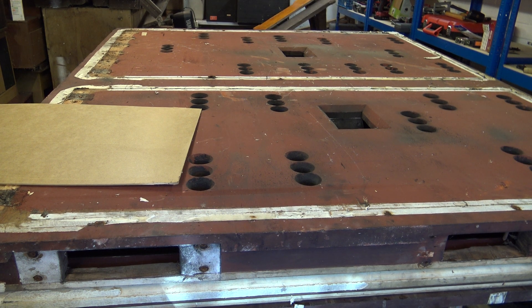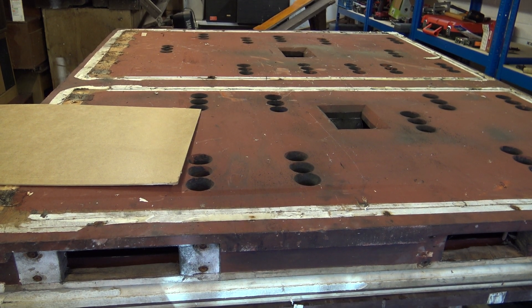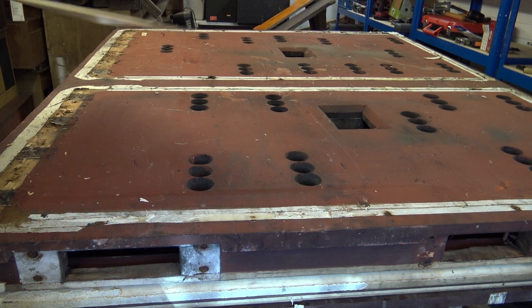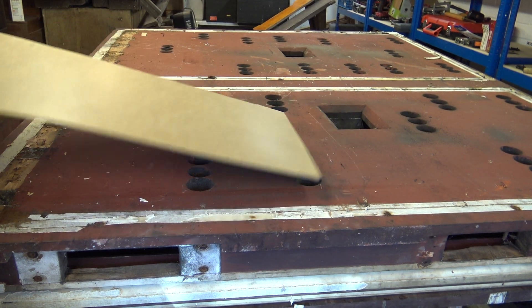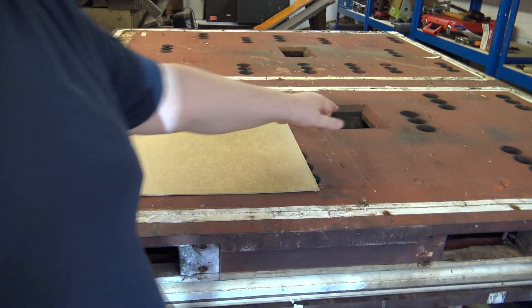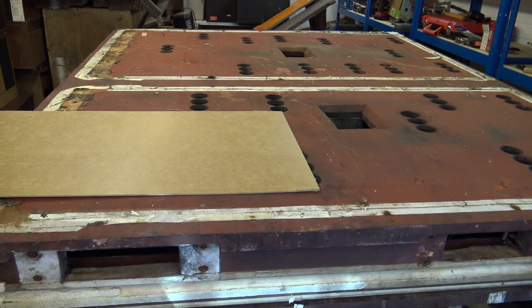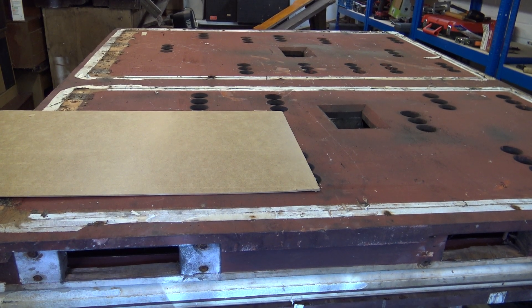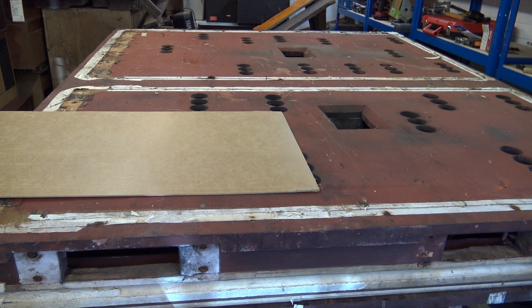For us to do this with two men, we're going to have to make this a panelled bellows, because we can't have 12 members of staff lifting this around like they might have done in 1865. We'll have to modify the top, but I had to do that with the Conacher so it's not unusual. We've got two emergency escape valves: if the bellows goes higher than a predetermined level, a cord inside will cause those to open and dump the air, stopping it from going too full.